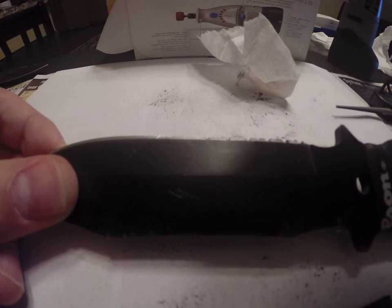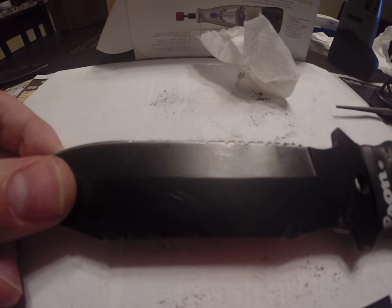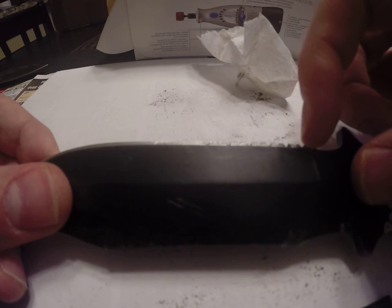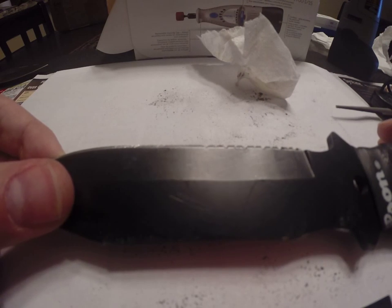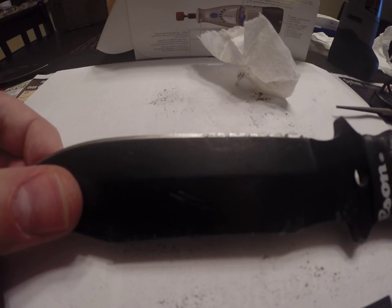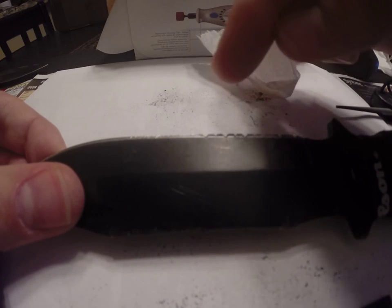If you just cut holes, it would tear a little bit, but it needs to be sharp inside each serration so that it can cut as it tears. That's really important. And the fact that you don't have pointed tips, you just have a flat, angled, sort of trapezoid shape tip, it's going to hold up better to wear and tear. And it's still going to have a cutting surface across the flat edges of the top of the serration.